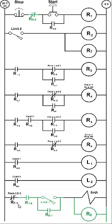And let's just look down here. This guy is a normally closed contact from that relay. And when that relay energizes, this becomes open. When that opens, it terminates this holding circuit. So we know that this then is going to de-energize. And as soon as that de-energizes, the cylinder starts to retract.